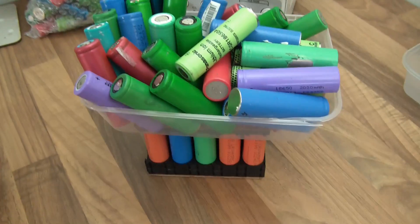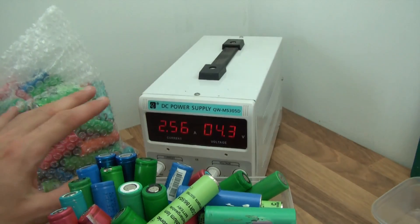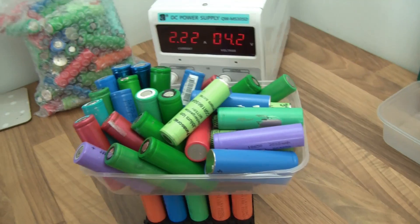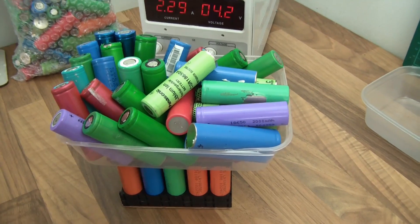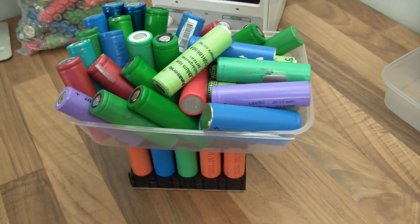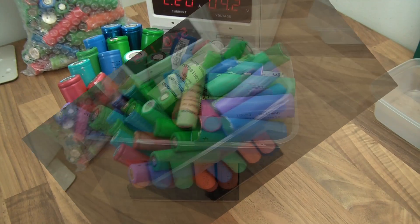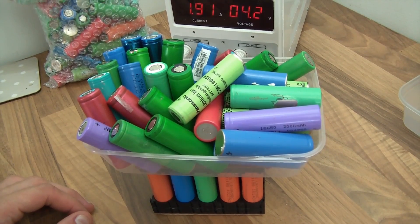At this point, if I wasn't sure about the cells, what I would do is give it a minute or two, then take this off and feel each cell. If any one of the cells is red hot or very warm, that's a pretty good indication it's a faulty cell and you want to take that out. It seems as though it might have a short or there's some problem with it. If you want to, you can check the voltage of the hot cell and you'll probably find it's something like zero volts — just chuck it. Stay with it for a minute or two, and if you've not got any problems, then pretty much just leave it for 10 minutes and check again.